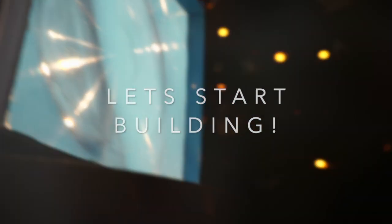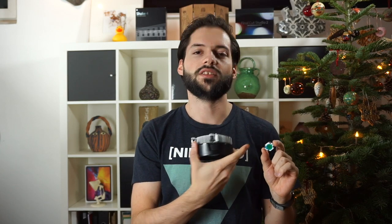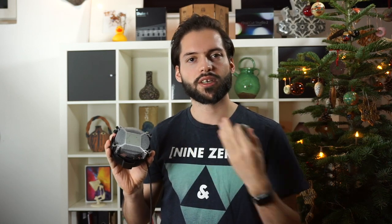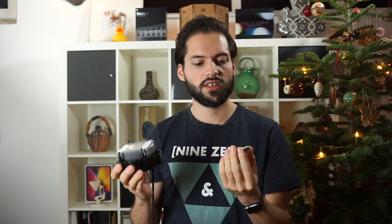To produce this amount of light we need a high-powered LED — this LED is around 10 watts and produces around 7 watts of heat. Therefore we need a pretty big heat sink. This is an old heat sink from my Ryzen 5 CPU; I put a bigger one in my computer so this is leftover. It's a 65-watt heat sink, big enough to passively cool the LED. I'm going to remove the fans, attach the high-powered LED, and see if it works.